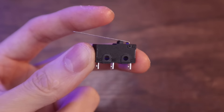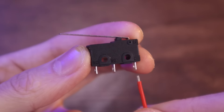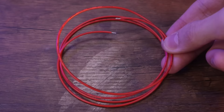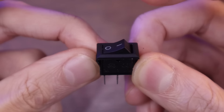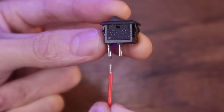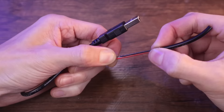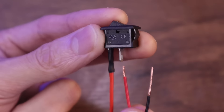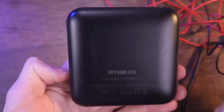This thing right here is a limit switch. I'll take that red wire and solder it to where it's labeled C. Then I cut a new strand of red wire — one end gets soldered to the limit switch where it's labeled NO, while the other end gets soldered to this rocker switch where it's labeled 1B. And finally, I'll finish things off by adding a USB cable. The red wire of the USB cable gets soldered to the rocker switch where it's labeled 1, and the black wire of the USB cable gets soldered to the negative leads of the LED strip.